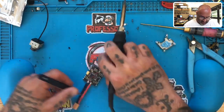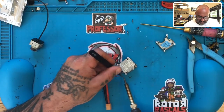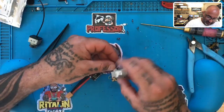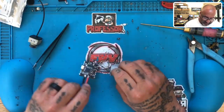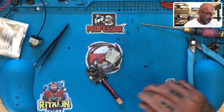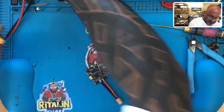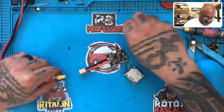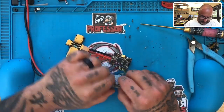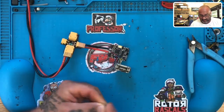I need to extend these wires. Okay, flip it all back over like that, because I do want to put this top plate back on temporarily while we test this out. Everything looks good — let's get our smoke stopper. We're running 12.3 volts, which will be fine. Let's add our smoke stopper, put a screw in here just to hold the plate in place, and stand this up.